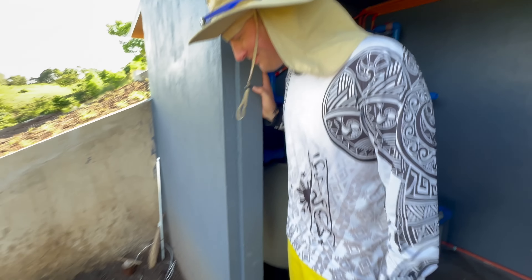Before we start vacuuming, we always do a morning water test. Chlorine is getting super low — almost zero. The pH is almost 7.8 which is pretty much perfect. So we have to add some chlorine. Pool pump is on and set to waste — we're vacuuming the bottom to make it super clear.